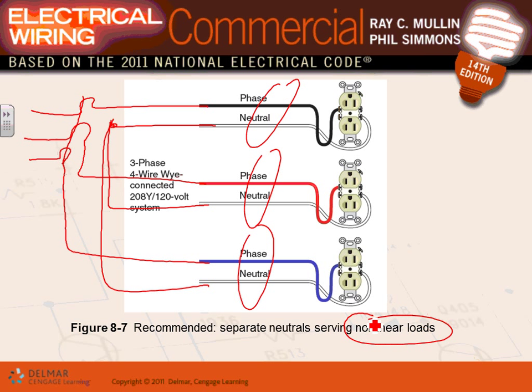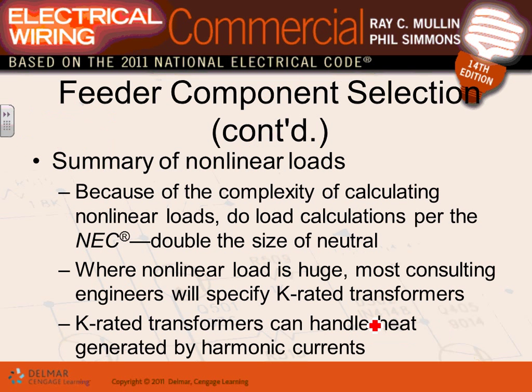Now what is a harmonic load, guys? I call them the sloppy eaters. When they digest electricity, they digest it in a way where, if it's coming from a three-phase system, it would not cancel itself when it goes to the neutral. So what does that mean? Instead of canceling each other as they reach the neutral, they actually add each other up. So who cares? Then the neutral will be overloaded, so you can burn your neutral.